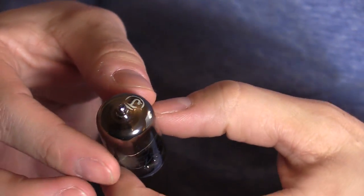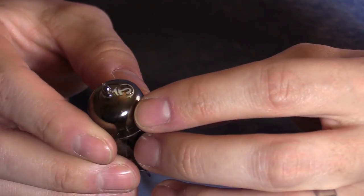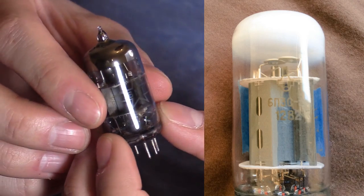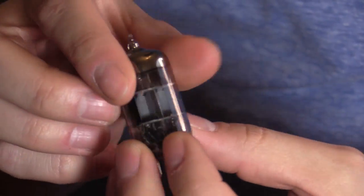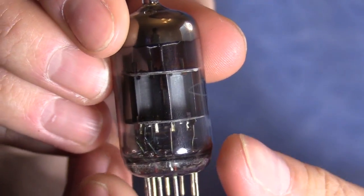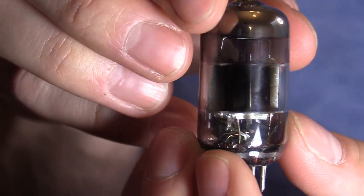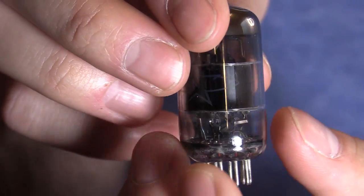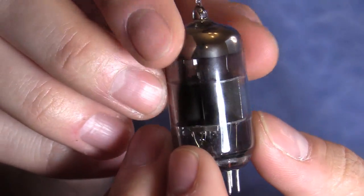Right here on top of this tube is a coating, and you can see it's either silver, black, or gray. If you see that it's white, then you may have a crack in your tube. And if the tube does not get warm or does not glow, then most likely the tube is bad. On this tube, you see how it's clear right there? Spin it around and it's black — that is a sign that it's going bad or is bad. That could be a sign why we're getting that hum coming out of the speaker.